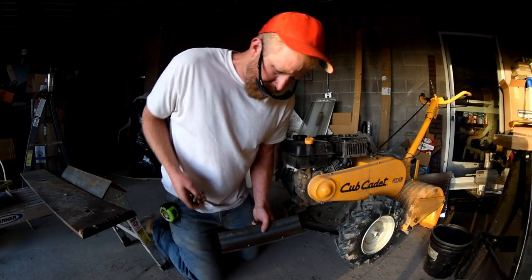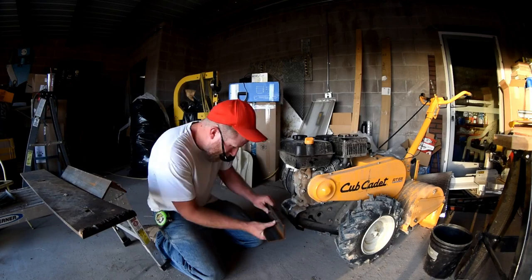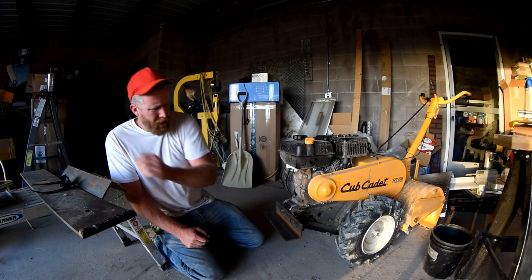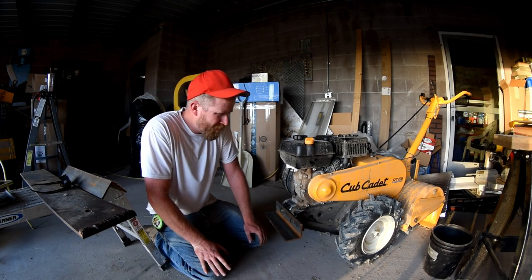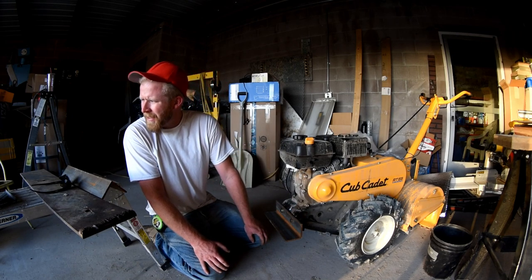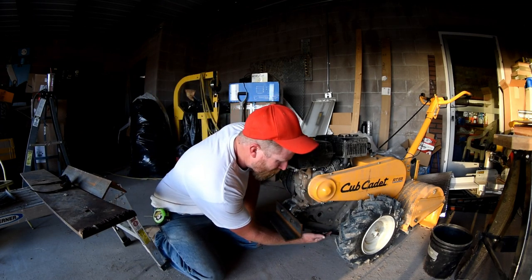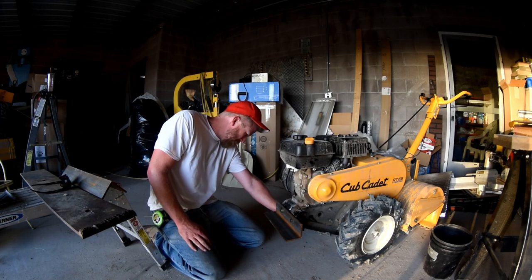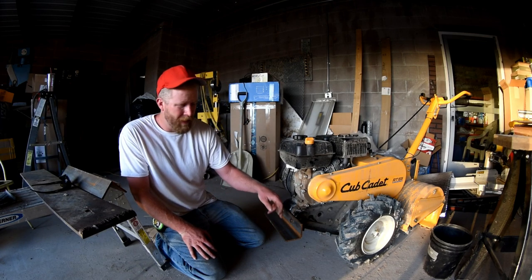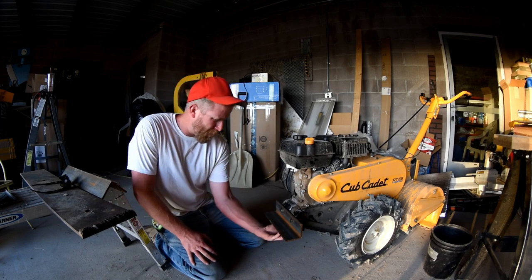So we've got our base main mount — 1.5 inch grade 8 bolts. This may be strong enough, but this frame is really thin. So we're going to put a plate on the underside down here. I'll use this notch and there's a hole right here, and then I'll probably do some kind of pinch on the other side. We're going to bring it up, weld it to this angle, and then the main hitch that everything hooks to will be off the bottom of this.